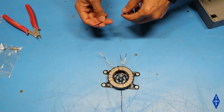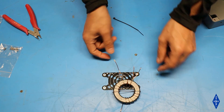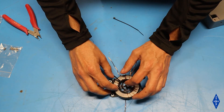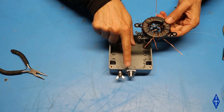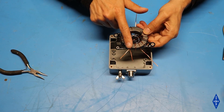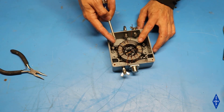Next I'm going to attach the toroid to the mounting plate using the supplied zip ties. I'm going to orient this so that the side of the toroid with the three wires extending is on the same side as the words 'HF Kits' on the board, and furthermore so that the single wire is pointing in the direction of those words. Then I'll drop the balun assembly down into the box, orienting it so the side with the three open wires is facing the SO239 connector and the two soldered-together wires are toward the right facing the counterpoise connector, aligned with the counterpoise hardware. I'll bend all the wires up a little, drop it down into the box, and install the four screws to hold the board down.